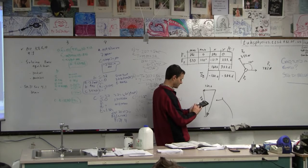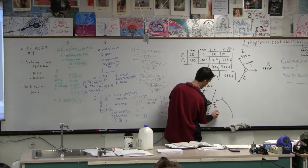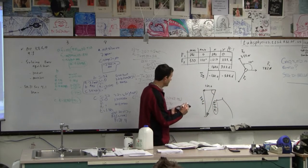This is the square root of that squared, 160 squared, plus 333.6 squared. 370. Is that the right answer for the hypotenuse? 370 newtons. And then I'm just going to find this angle right here.